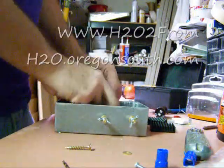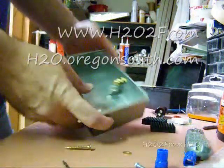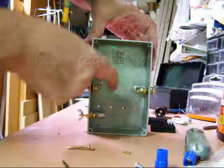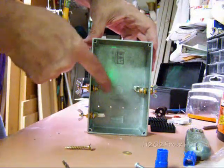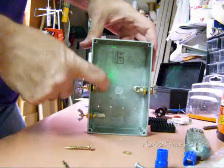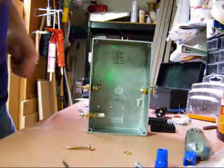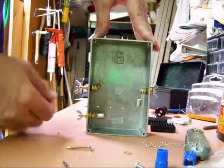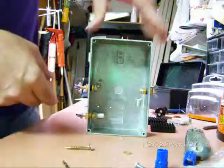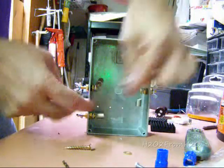I've got to decide how I'm going to bend these and where I'm going to position them. I'm going to try to relieve them and angle them and then put in a service loop so these can actually be removed and put back in if they get loose. That way they won't be bound by their connecting wires. The last ones I ended up having to swap out because I had stainless steel ones in there and they don't work — this whole area was just getting smoking hot. So without any service loops it was very difficult. I'm going to put a couple of service loops in here so you can just slide these in and out, no problem.